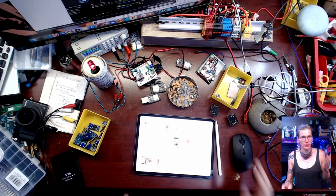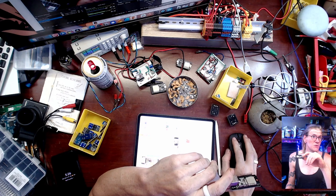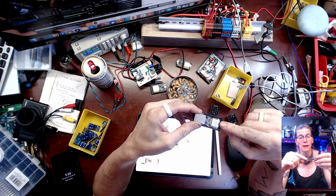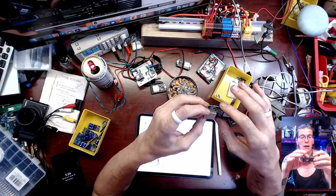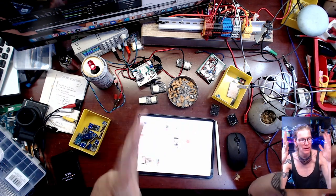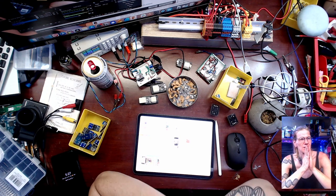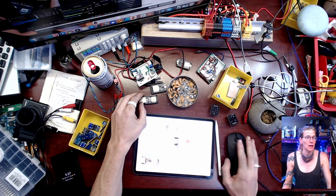So basically I've taken this, an ETH01-WT32. It's got an ESP32 clone on it, and it's on pins, and it's got an Ethernet port. This is not PoE. There are boards that do PoE, but I don't think I really need it. I've already got my power runs. I'd love to do PoE, and plus the problem with those is they're quite a bit larger, and I don't know that you can actually pull much from them. So I think I'm just gonna stick with powering these devices, and especially this, I need the higher voltage anyways,